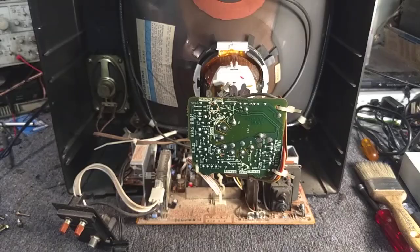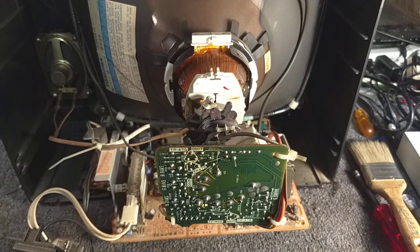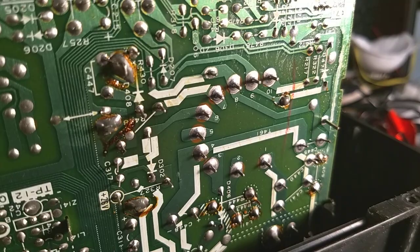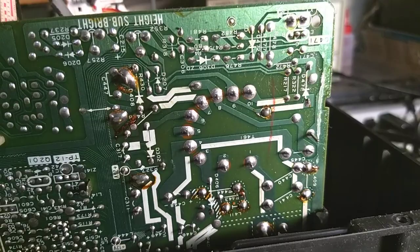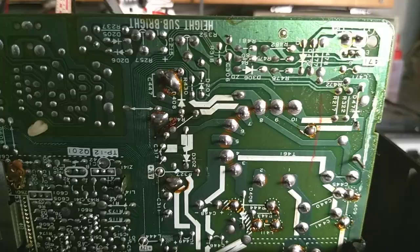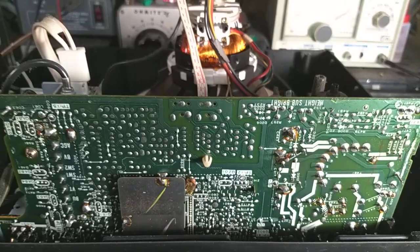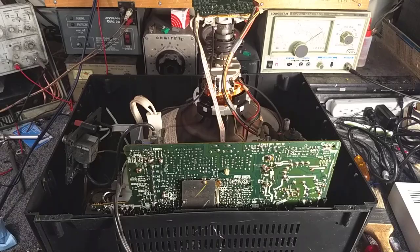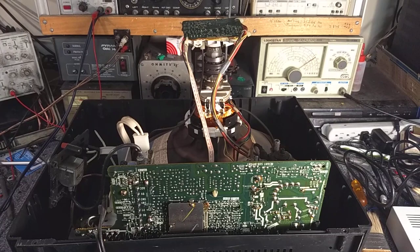In addition to the caps going bad, right around the flyback there are a couple of soldering connections that could be redone. These resistors up here tend to break loose, but this board just lifts out — there's one screw that holds it in and the whole thing lifts out, it's easy to service. I'll definitely do that before I put it into regular use. This one isn't going to be a shelf queen. It's a nice little set — I'm really glad to have found it, and I hope you guys enjoyed watching this little segment. More stuff to come.